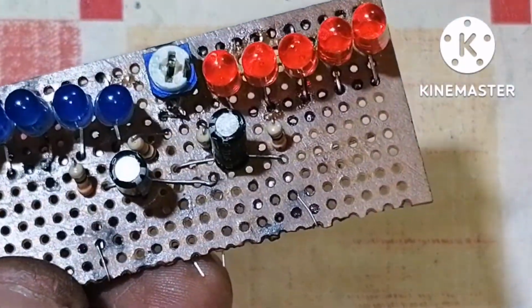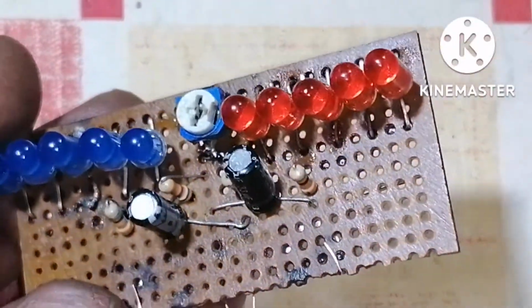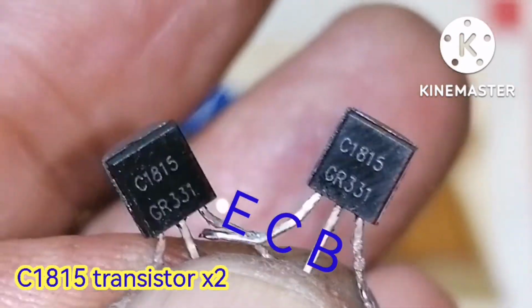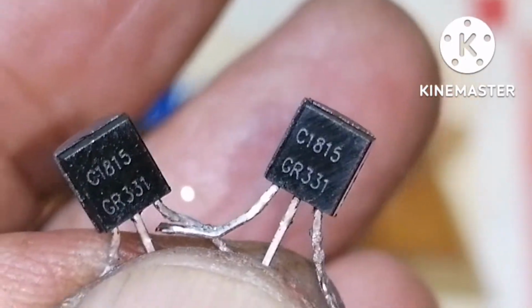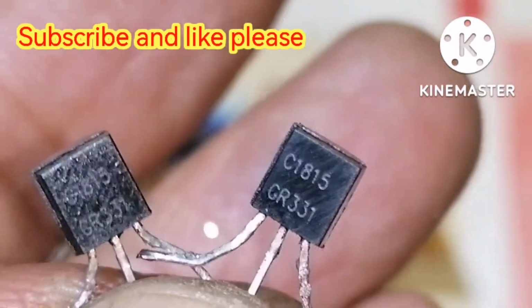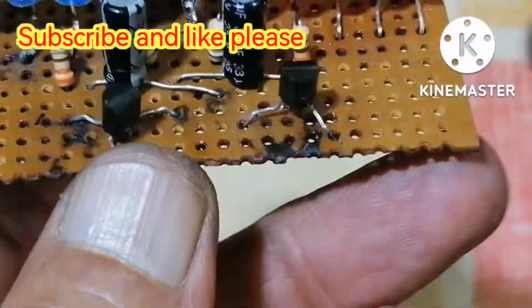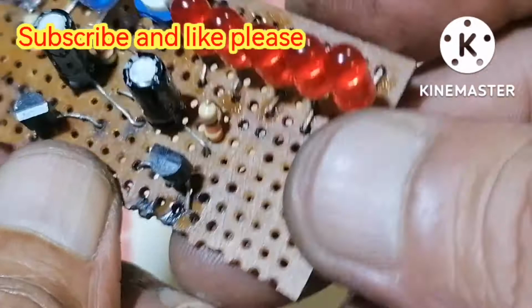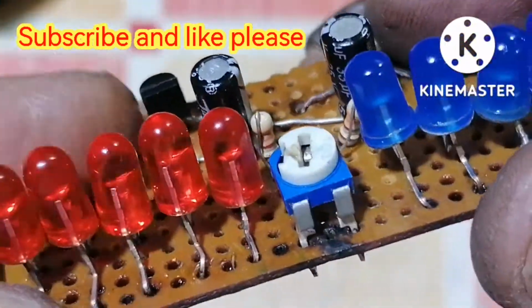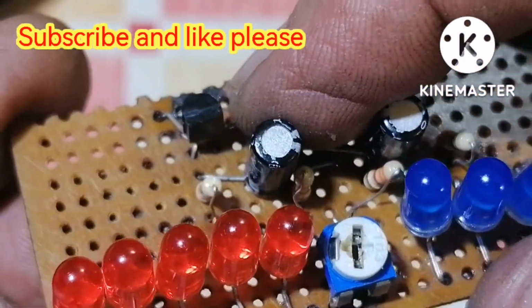So I will solder this one. I'll show it to you. For that we will use two of that one. This is pin 1 is emitter, pin 2 is collector, pin 3 is base. Okay, C1815 over here. The first pin is the emitter, second collector, third is base.